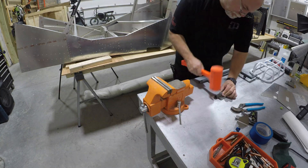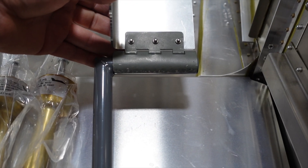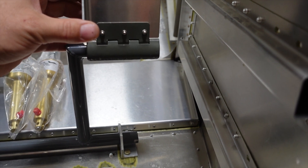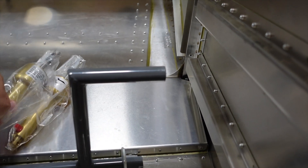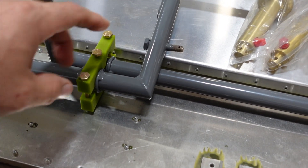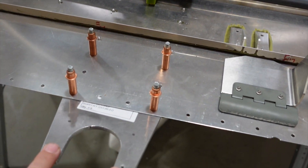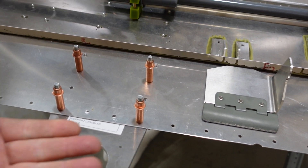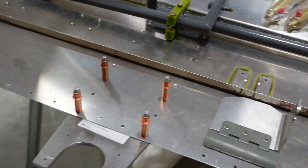I'm going to put some video up here just showing how I put it in a vise and slowly bent it. They do now have an assembly guide showing that process. But once they get bent, you're going to get them positioned left and right. Once I put the brake cylinder down in that lower mount, I'll be able to line up that flange and get the rod in line so that it's not on any kind of an angle. Everything else here is just temporary — we've got the bushing there, bolts that have to all be tightened down, but we want to do that after we do painting in this forward cabin area. Another finishing component here is this lower support bracket for the front landing gear — there'll be a nylon bushing that rests on there, and that has to get drilled out with hardware attached.